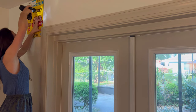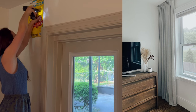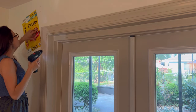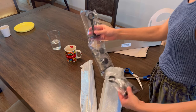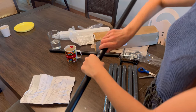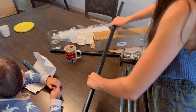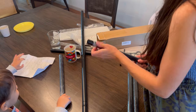I went with the rule of two-thirds. There are different ways to hang curtains — you can hang them all the way to the top, which adds a very contemporary look, but I wanted the two-thirds look, which means you divide the distance between the top of your window frame and your ceiling and go up two-thirds. This is a very traditional look. Also make sure your bracket is out about six inches from the window frame — that will make your window look even bigger.